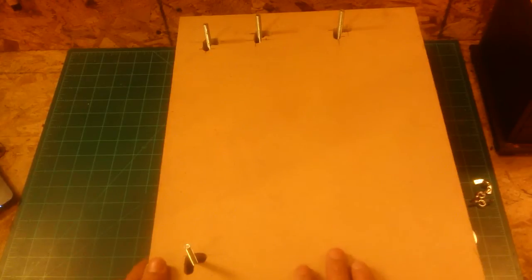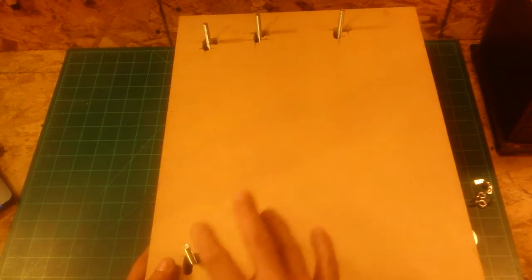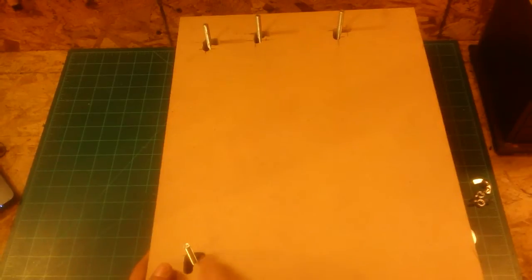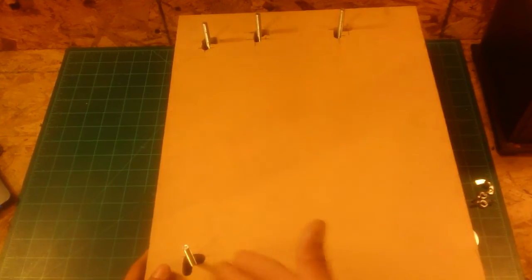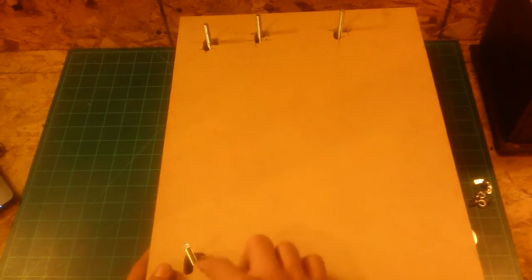Now on the bottom piece of wood, you don't need to do that. So when you drill it out, if you have these clamped together and you drill your holes in there, drill your initial 4 holes, then take the clamp off, and then do your other holes, because you don't need to drill at the bottom. You can drill if you want to drill all of them at one time. It's not going to hurt anything, because the foam will cover those holes.